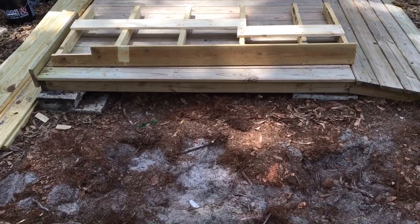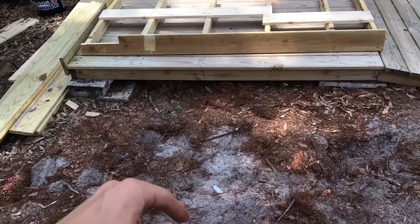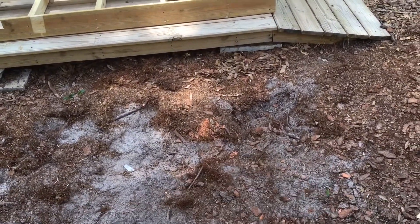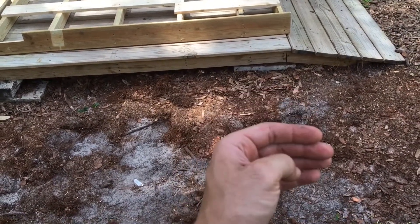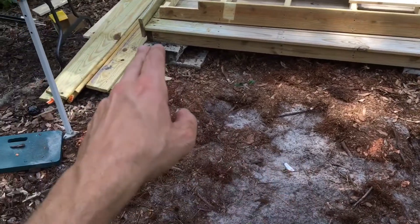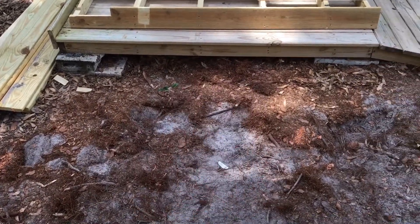This is quite a slope — it comes out 32 inches. I can get five full pieces of five-quarter with a gap of a speed square. That distance comes out here and across; it actually drops eight inches from here to there on this side, but down here it drops over a foot, so it changes slope two ways — it's a compound slope.